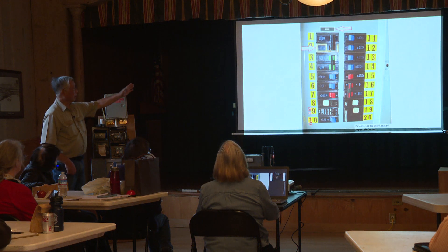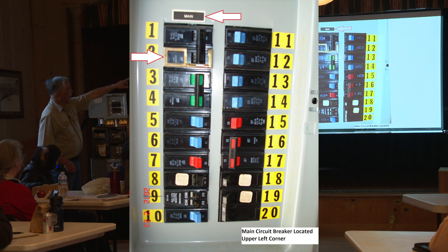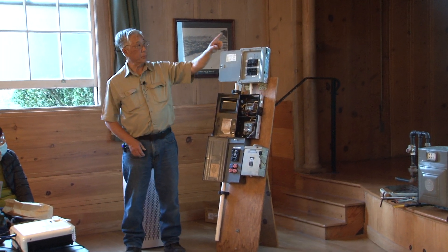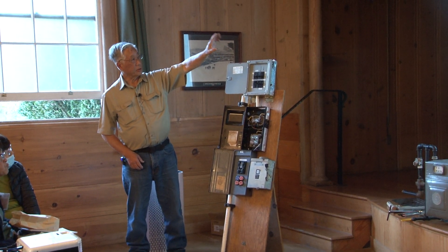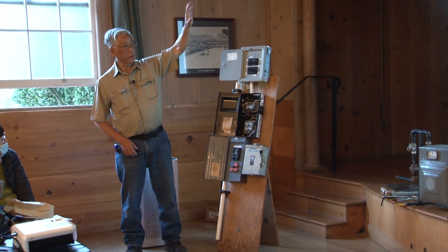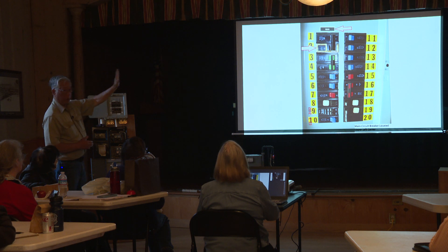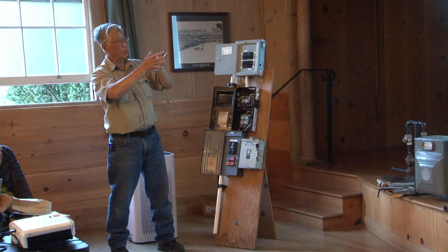The most modern one is your circuit breaker. The top left is generally the main shutoff. The main shutoff has a bar tying the two together — you cannot shut just one leg off, it has to be both. Look for the main at the top left. If you shut that one off, towards the center is on, out is off.